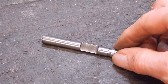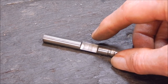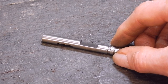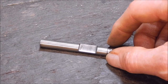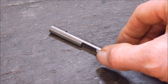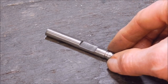You've got to remember that job was unsupported. If you were to try and machine hard stuff like this any other way, you're going to get chatter and vibration - it's going to be a mess. But when you grind, the pressures involved are so low and so light that, if you do it properly, unsupported work is not an issue. You saw that it never looked like turning the lathe spindle even though it was a rotating action. The spindle never moved because the pressures are super light. You never force a grindstone - just do featherweight cuts and it will go through the hardest materials like a hot knife through butter.